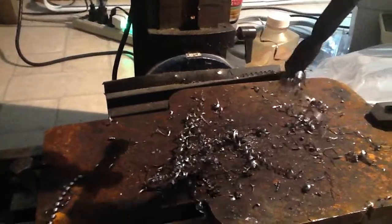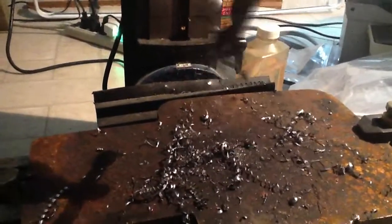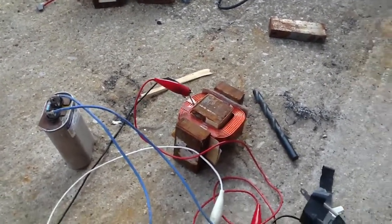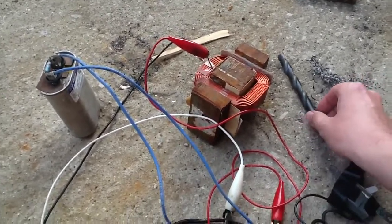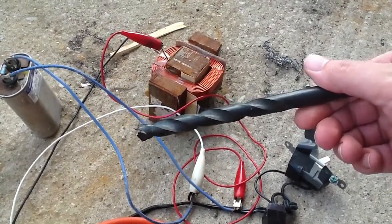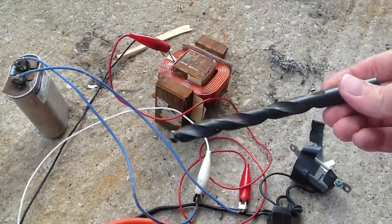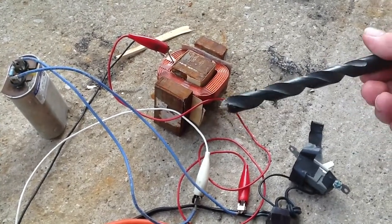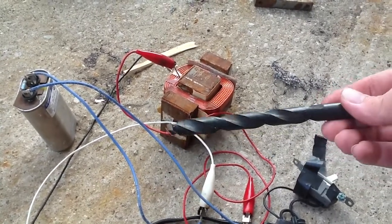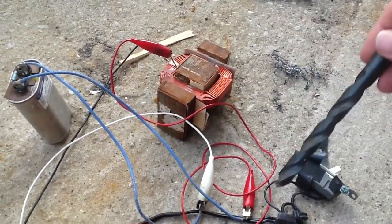See this? Not good. It's generally considered a bad thing if your drill bit or any kind of machine tool becomes magnetized, because the chips will stick to it — the turnings or the cuttings or whatever you like to call them — and they won't clear out. So you don't want that.